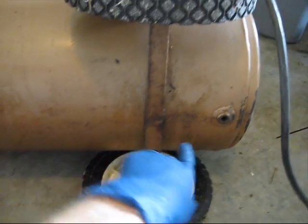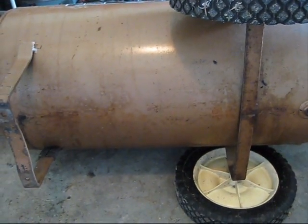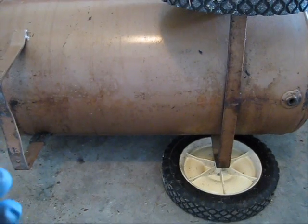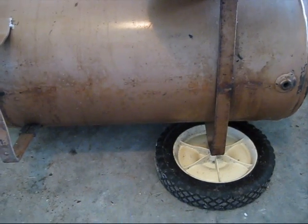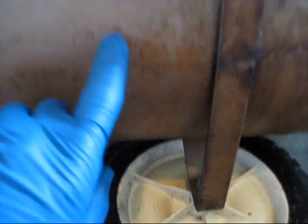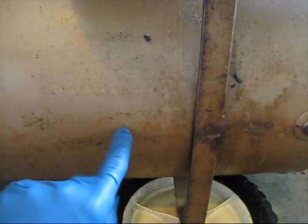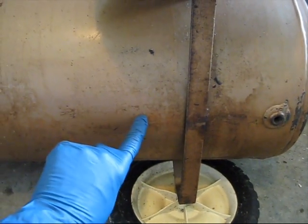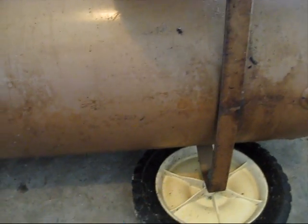When I got this one there was a pipe plug in here. I turned it on, let it build up a little bit of pressure, then turned it off because I had to go do something. When I turned it off I could hear something leaking and I thought it was just an air fitting, so I went looking for the leak. I found it wasn't leaking from any of the fittings — it was leaking from right here, around this area. It's actually leaking from a pinhole in the tank.